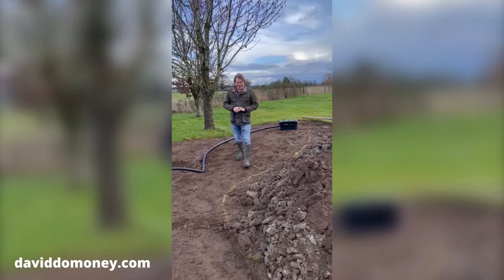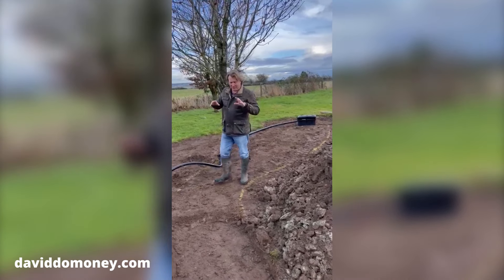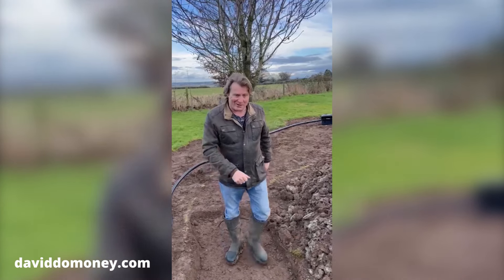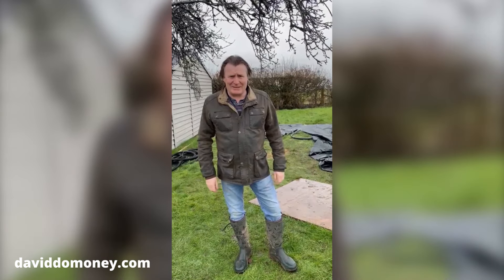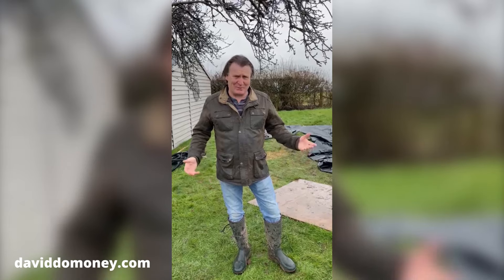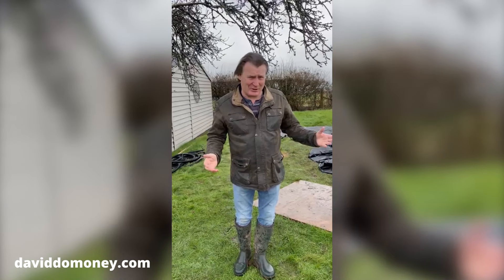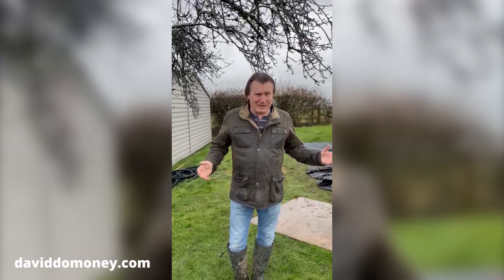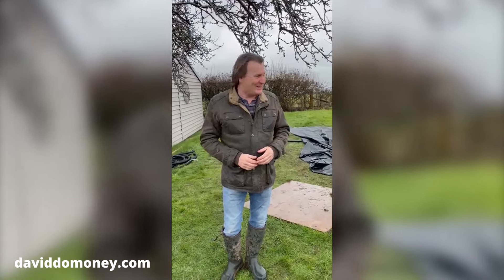If it was just a pipe put against a few stones, it'll be spurting and jetting all over the place — a bad flow right from the start. But this open mouth at the top splays and spreads the water, meaning the flow down has an excellent beginning point. That's what the wide mouth does on this spillway. So there you have it: big sump to hold the water, proper pump and pump chamber, really good wide bore hose to take it to the top, and the spillway manages the flow on the way down. The next job is to put the liner in — that is going to be a challenge and a half.